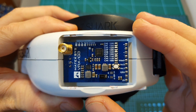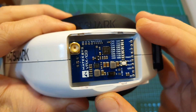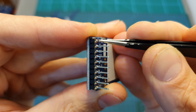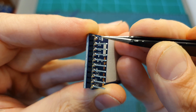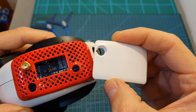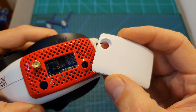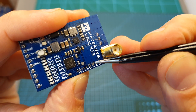The video receiver is designed to fit any standard FatShark compatible module bay. In case your goggles came with a 10-pin straight pin header you should simply remove it, as otherwise it's not going to fit inside the FatShark module bay. Unfortunately it's not compatible with the original cover that comes with the FatShark HDO and HDO2, but you can use the cover of the ImmersionRC RapidFire.